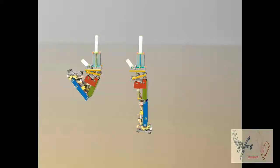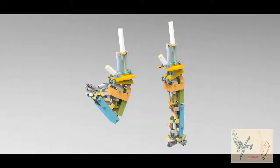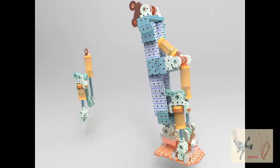Because of this, we want the engine to run very slowly. We want the RPMs of this engine to be in a range of 1 RPM to 160 RPM. That's it. That's all it does. Our design objective, our design thought on this engine, is that we will have a large cylinder going slowly so that we will have a quiet engine.